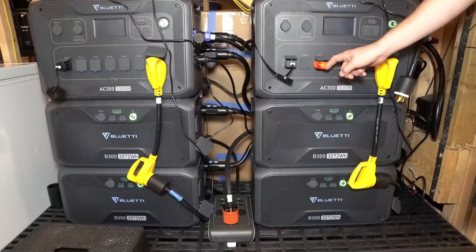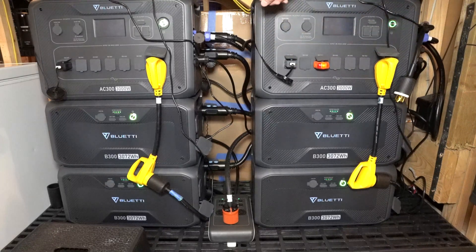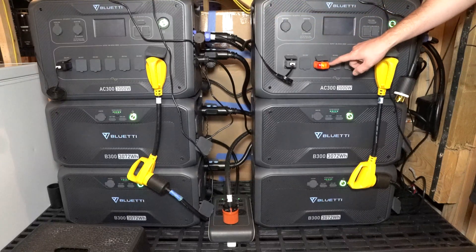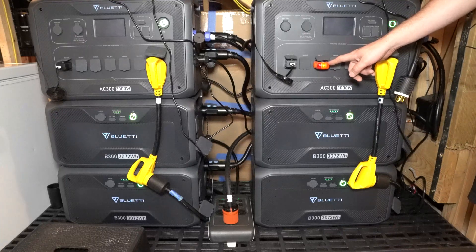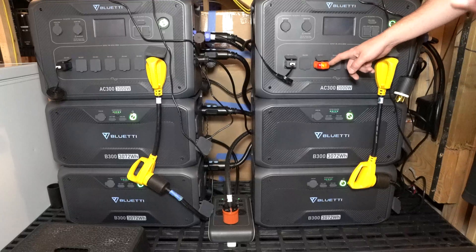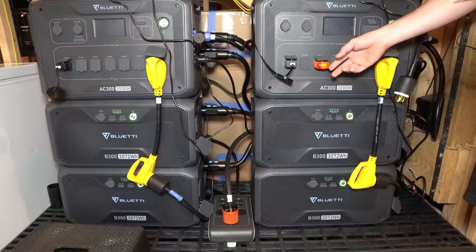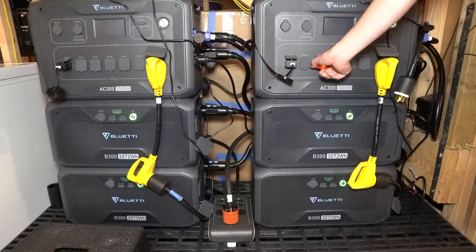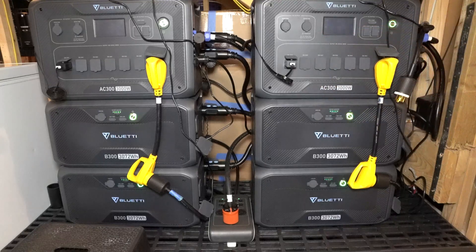When I had the outlet plug tester plugged into the master unit, I was getting feedback from my ground — about 8 volts on my ground. Tracing it through my home, nothing in my house is actually producing it. I went to a couple of neighbors' homes and was quite surprised to find they were all getting a little power on the ground cable. So it's coming from our transformer.